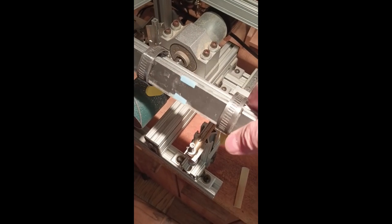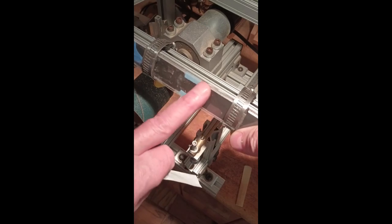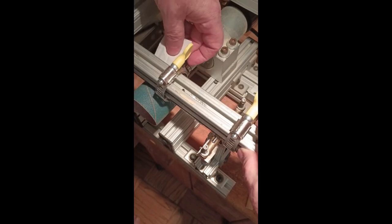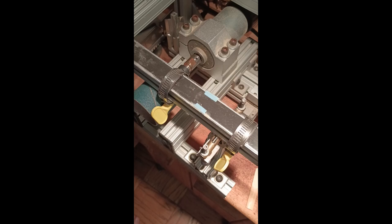To find out exactly the distance from where the model should be to the piece I'm carving, I put a model reed way up front that was exactly three millimeters thick and a blank that was also three millimeters thick. I put it back in this region here and just get the paper to pull through. I lower my follower bar until it's just pulling through, then do a little bit without the vacuum to see where it marks. We have a pretty good indication that it's starting right there — and that's like nine centimeters. I was using 98 millimeters, so I'm going to do another batch of four with a nine-centimeter spread. I'll put blanks in there with the leveled followers and try cutting four more blanks.